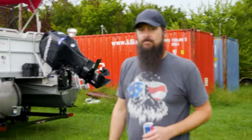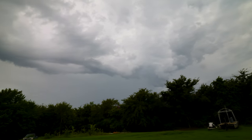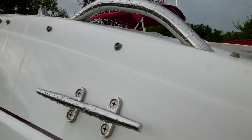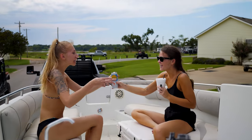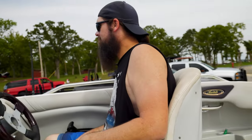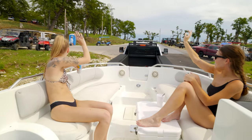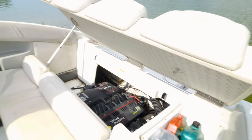We are up here at the lake to do a sea trial on the Mariah because we think it's fixed. It said 0% chance of rain yesterday and now it's raining today. We've got a few hours of daylight left. That is roughly where you broke down last time, Cody — about a mile away. That's our goal to beat. Temp is 100, oil pressure's good, volts are 12. That manifold is cold — that's good. No blow by.